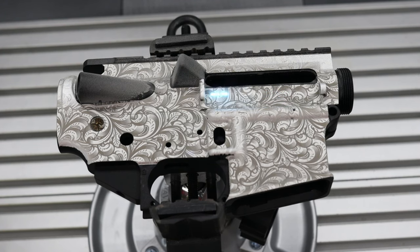So the fact that we got a little bit of fading, it's all right. It's turning out a lot better, but no, I definitely got that area. It's just not as, when I did that cleaning pass in the beginning, if you go back, you'll see. Now it is a little bit of a lower power at the highest spot and the lowest spot. I need to adjust that for the next time I try this. I did it dead on with the focus. I should have measured a little bit higher than the highest spot and a little bit lower than the lowest spot, and I think that would have compensated for that. But the fact that this even worked is so awesome. Thank you. Yeah, it looks pretty neat. I haven't seen anybody try a whole one because I thought it'd be just a dumb idea.